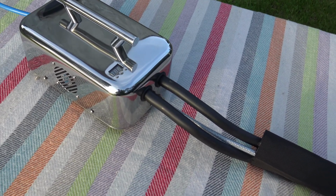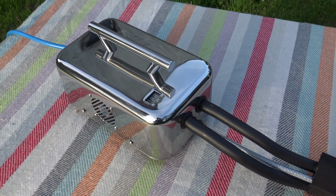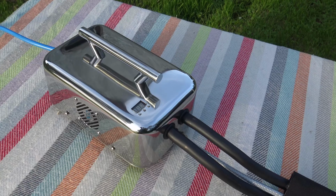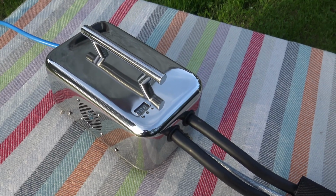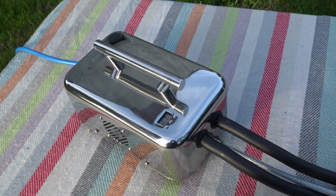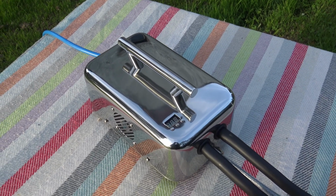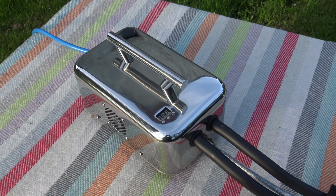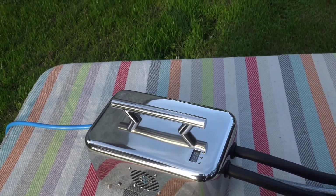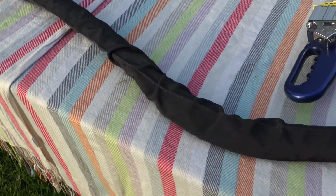The box is purged with argon, so it's basically purged just the same way dairy pipes are purged. It is sanded through so many different stages, then polished up to a mirror using different grades of soap bar polish. I think black is a starting polish compound, then it was brown, green, then pink for the final polish, but the green is the main, using different types of polishing wheels too, obviously. 8-inch wheels on a Metabo bench grinder.